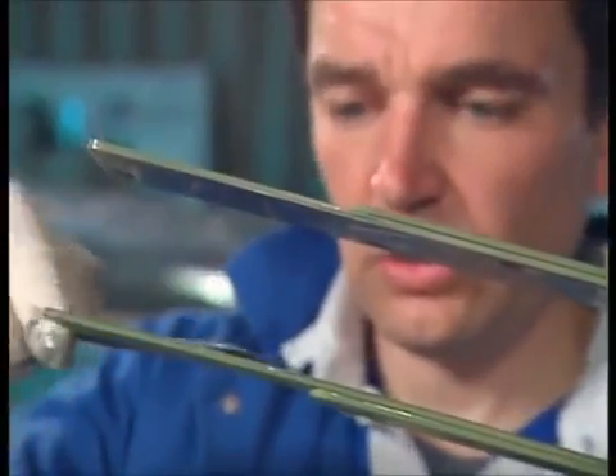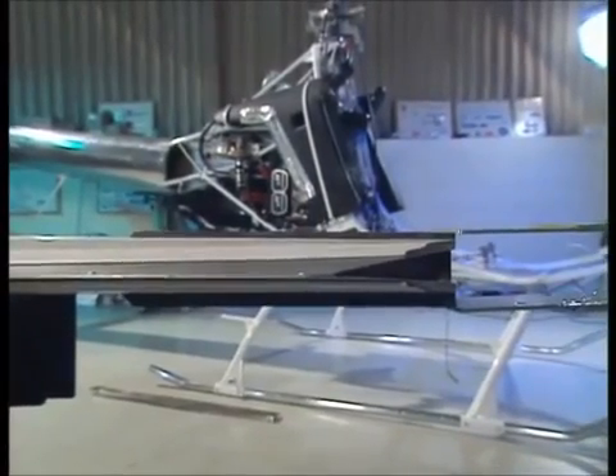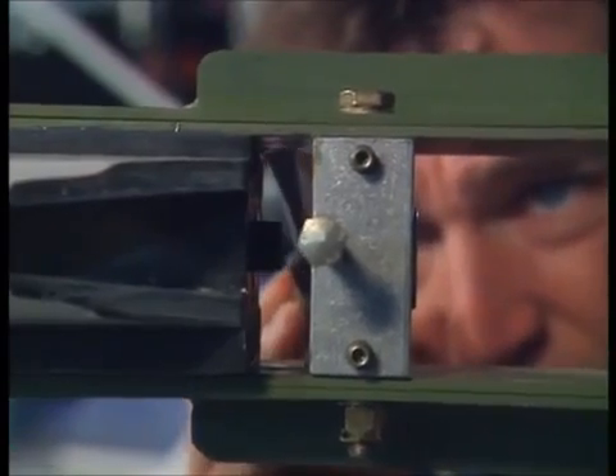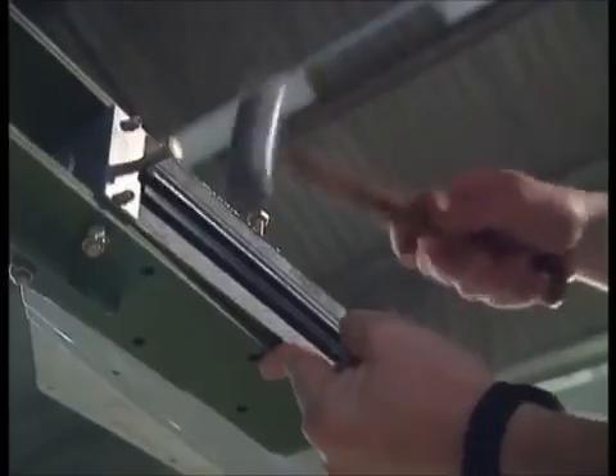You need to spread this adhesive quite thinly so you can still see the wood underneath. Obviously it's not just the adhesive holding your blades on — it's all bolted on as well — but it adds extra strength. Now it's a case of just sliding it over the wooden blocks, and try not to scrape off too much adhesive — it just glides on, which is nice. Just before it's fully on, clear off any adhesive that might get stuck to the locator block, and locate it with one bolt, making sure it doesn't push the plates off on the other side.